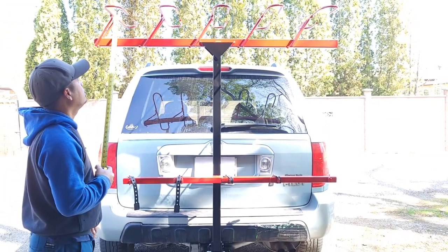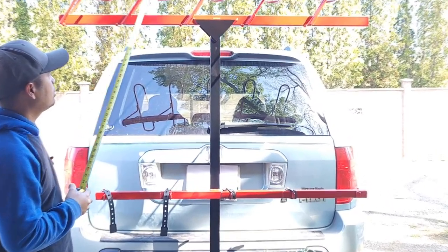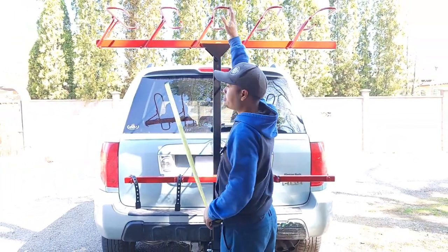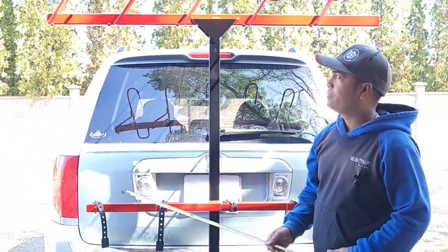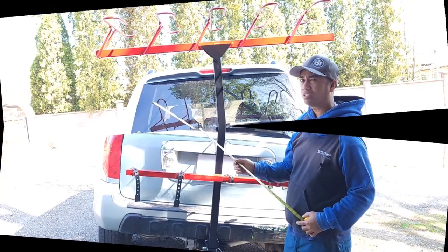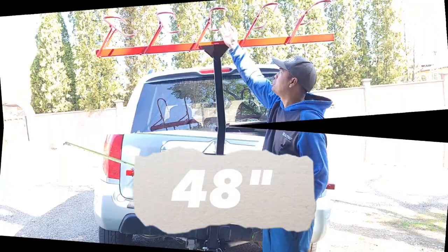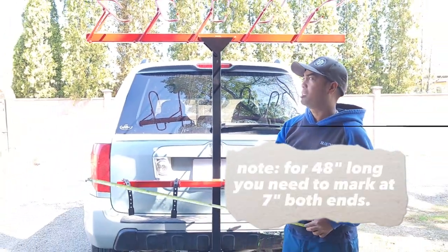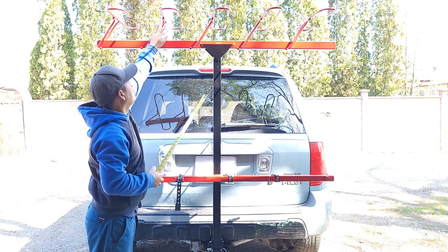The hoop is made of half-inch round bar, cut at 46 inches long. Next time I'll add an extra 2 inches — making it 48 — just to make the gap shorter, so I can cut it to around 40 inches for the short part.